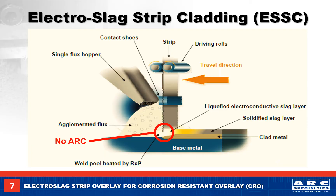You will see there is no arc when we look at the close-up video while welding. The resistive heating of the strip melts the strip, the flux, and some of the base metal. Because there is no arc, we only need to have flux on the front side of the strip. The molten slag shields the molten weld pool from the atmosphere on the back side of the strip.